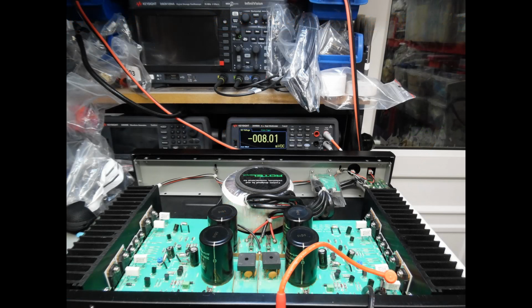So you can see the multimeter in the background. The hook clips are now connected. And then just slight adjustment. And this is repeated because as you make the adjustment, just wait a few minutes till you get stabilization and then repeat. Now remember, you may get it bang on 8 millivolts, but there will be a small amount of fluctuation, not high, but a small amount.